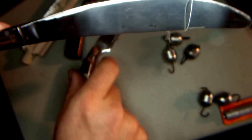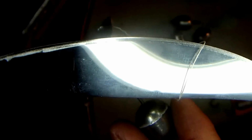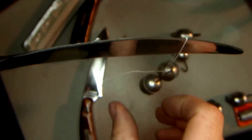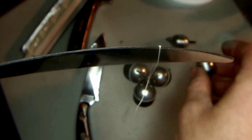All right, so check it out here. We got our butter knife, and we got that big back cut that we put on here, and then the secondary edge up here. This is all just to show just how easy and important it is to take your time and make that extra back cut when we're doing this. So this is how sharp you can actually get something as plain as a plain old Jane butter knife here.